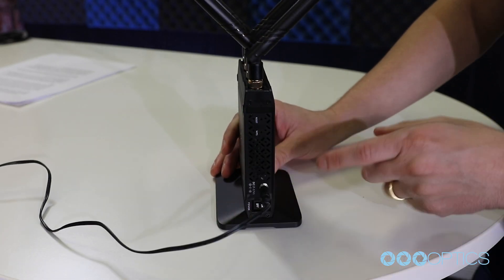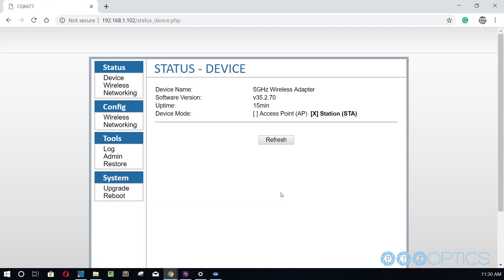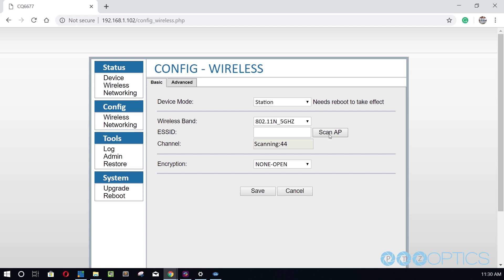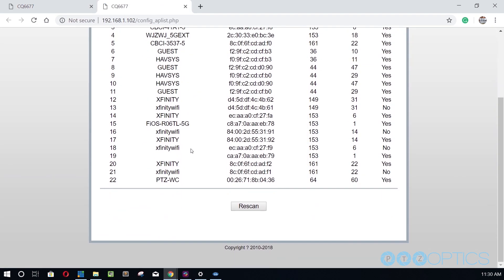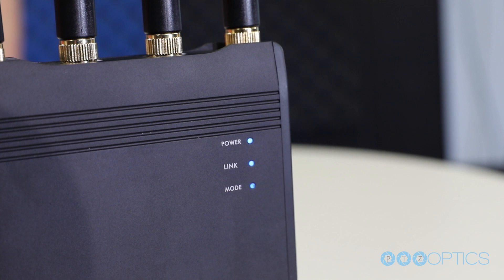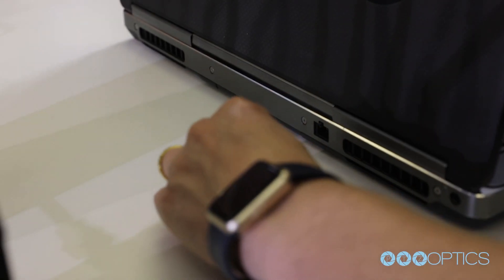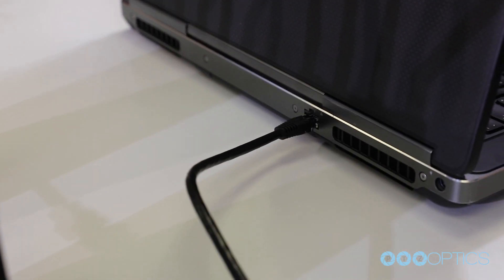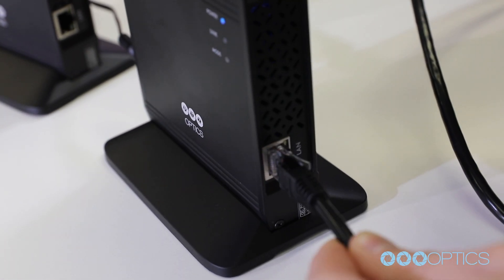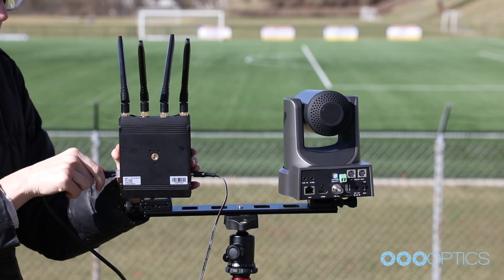Power on and connect the PT-WC-G1 station, enter the device IP into your internet browser, and log in with the credentials as before. While logged into this device in Station mode, power the access point. Click Scan Access Point in the Wireless section of the Config menu of the station. Select the ESSID configured in the access point and enter the passphrase into the new window. If successful, the indication connection link light will change from flashing to solid. The devices will retain the connection through a power cycle. Power on and connect the station to the LAN port of your network device, then power on your network device. You should be able to access the network device through this station. Note: to avoid creating a loop in your network during setup, connect each base station unit one at a time for configuration.